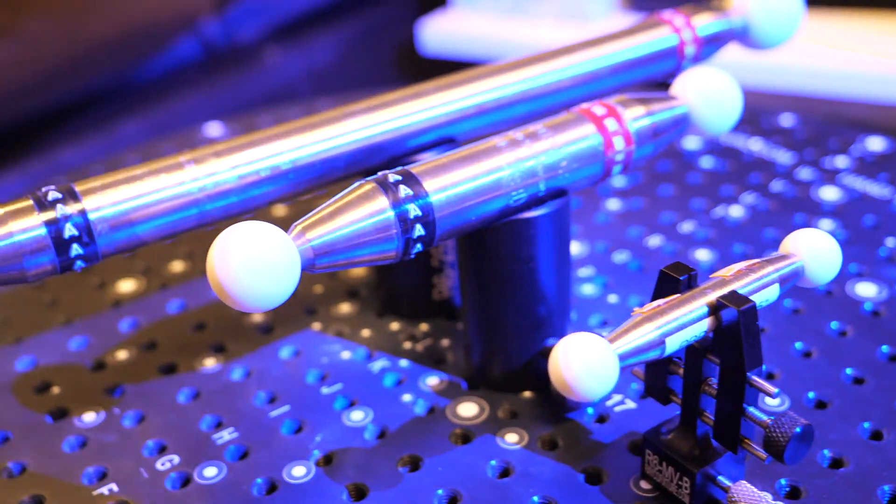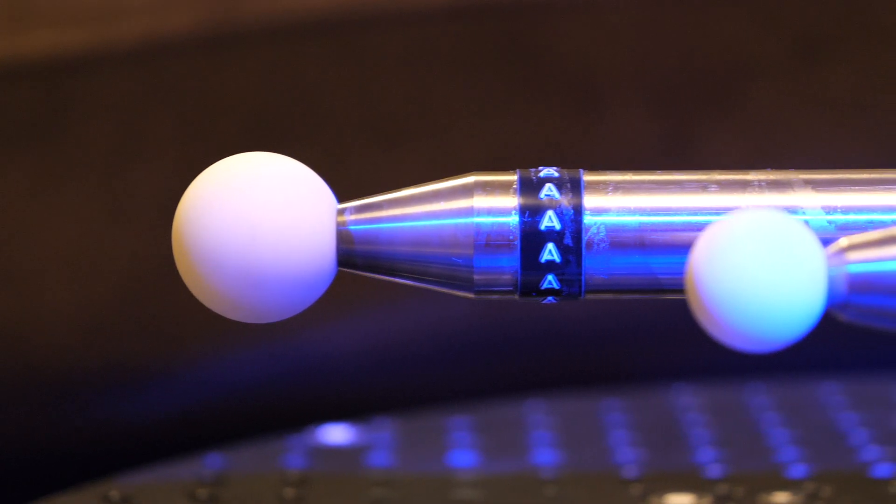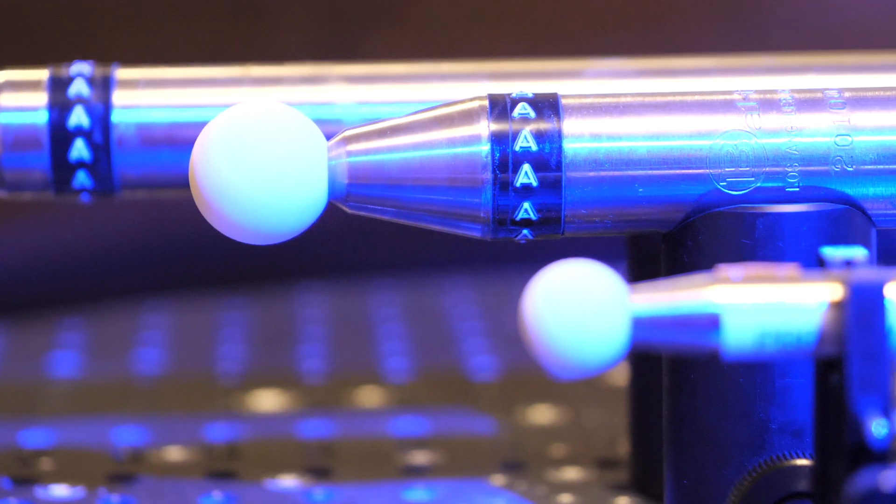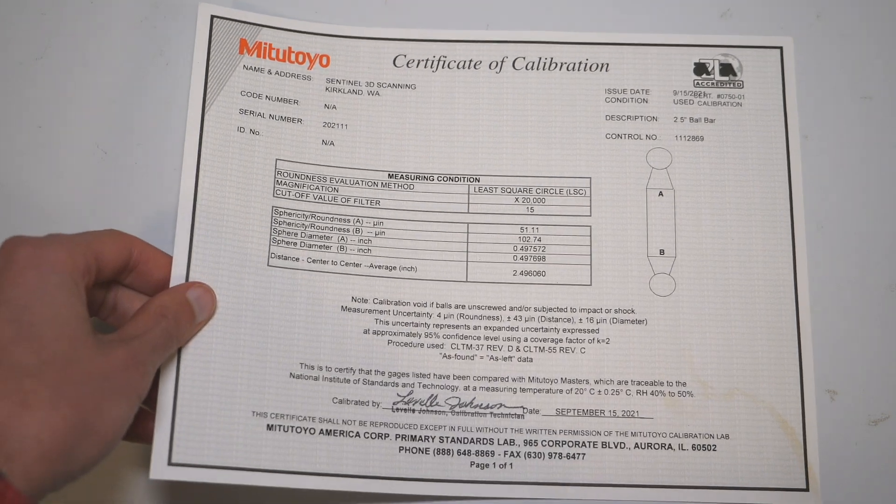For instance, if you're going to be measuring a lot of internal diameters, maybe make your own calibration standard with several internal diameters. Or if you're measuring with a CMM, consider ordering some ball bars to be used for B89 testing. Regardless of the type of standards you order, make sure to have them calibrated and to keep calibrating them on a routine basis.